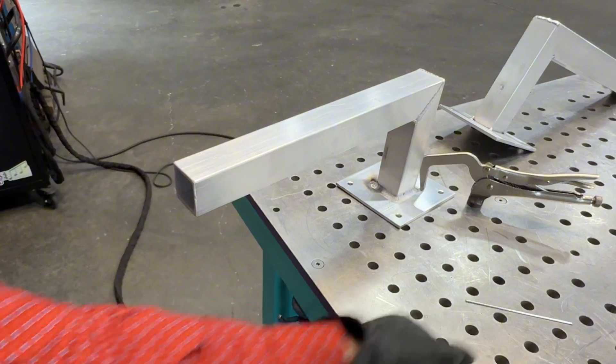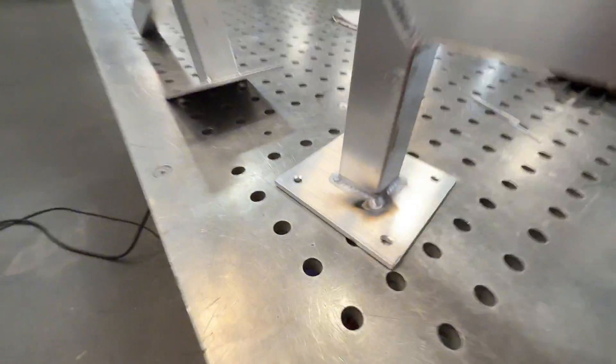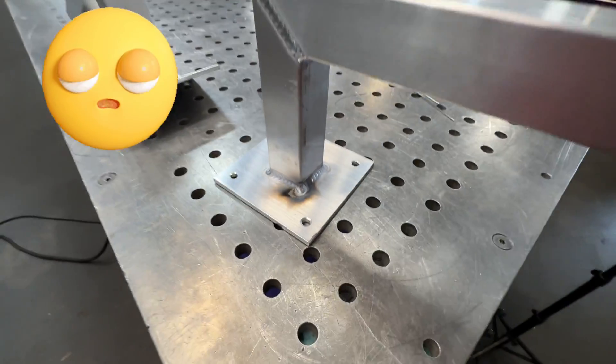While it's nice and warm and preheated we're going to weld that bottom plate too — not too hot, actually a perfect temperature. Before I start the arc I scratch the tungsten on the metal really fast without hitting the button, and that helps a smoother arc start. Just let her rip. It takes a little more heat to get to that area — I was at almost 250 amps for this part since it was warm. There you have it — all good, didn't dip the tungsten once.